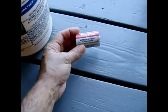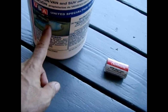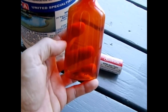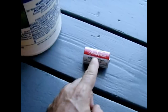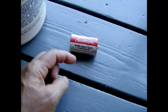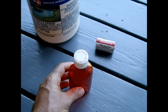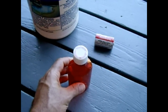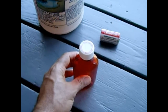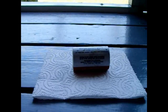It has to be one of these heavy-duty types, as long as it's not alkaline. In the process of creating the acid flux, we're going to take the muriatic acid and pour it into a small container — maybe about three ounces or so. We're going to remove the zinc from the battery. It is highly recommended that you use safety goggles and gloves and have a garden hose nearby in case you splash yourself with the acid, and also have some baking soda on standby — you can neutralize the acid with the baking soda.